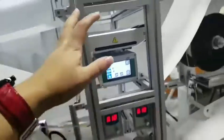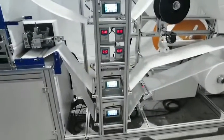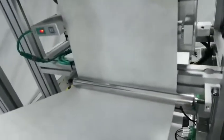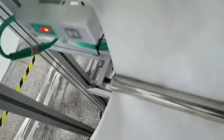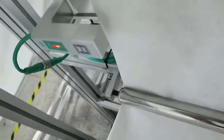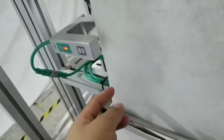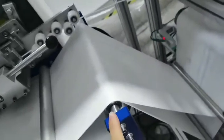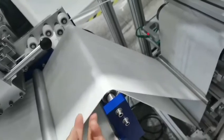This is a correction device — total four pieces: one, two, three, four. It can automatically latch the fabric to the right position. There is a sensor and a valve, so the sensor tests the fabric to latch it and then release it. You can see this two-layer fabric is in the correct position.